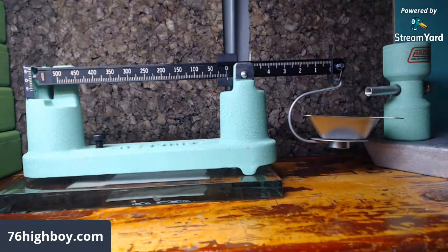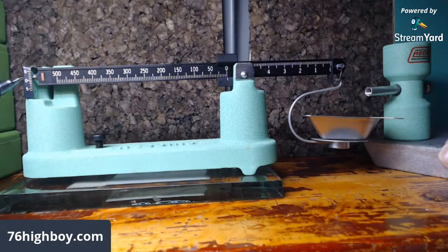That you would say, okay, something drifted. On the last charge that you ran for however many cases, let's say you ran 5 cases, we're talking extreme load development. You ran 5 cases and you put it back at 0 and you were that far off, then what I would do, I would empty out those cases. I would re-zero that and do it over.